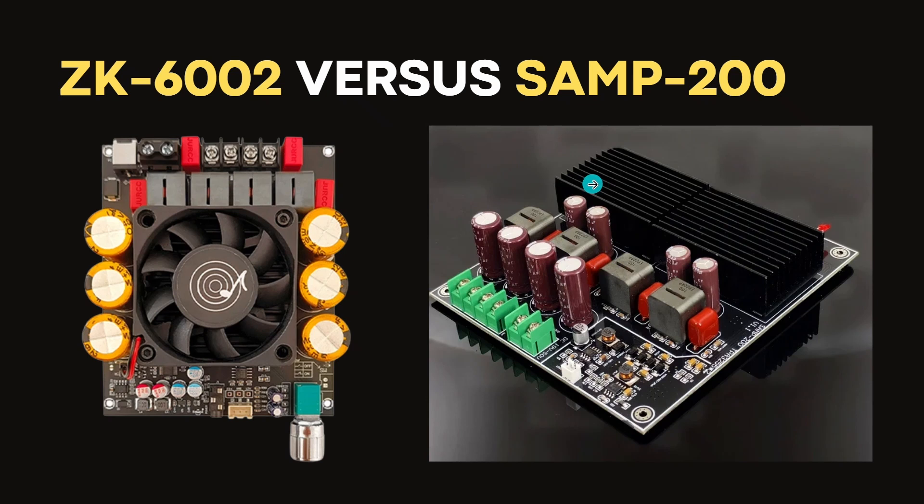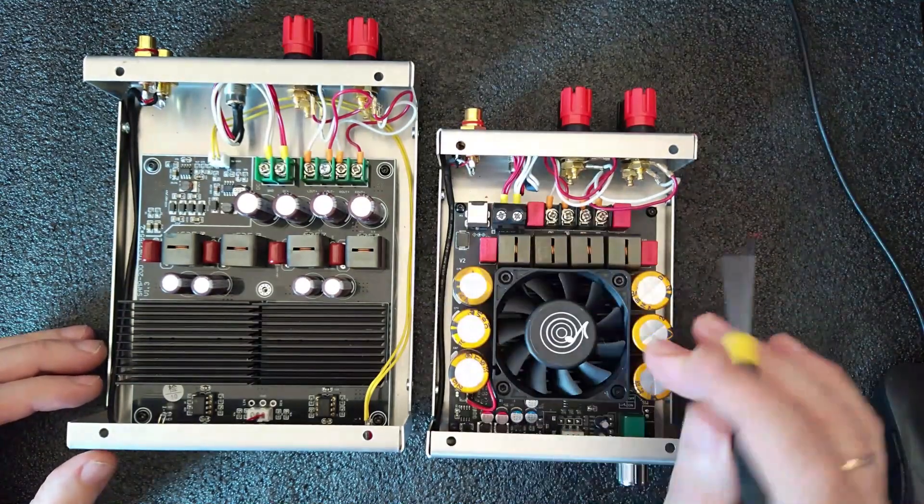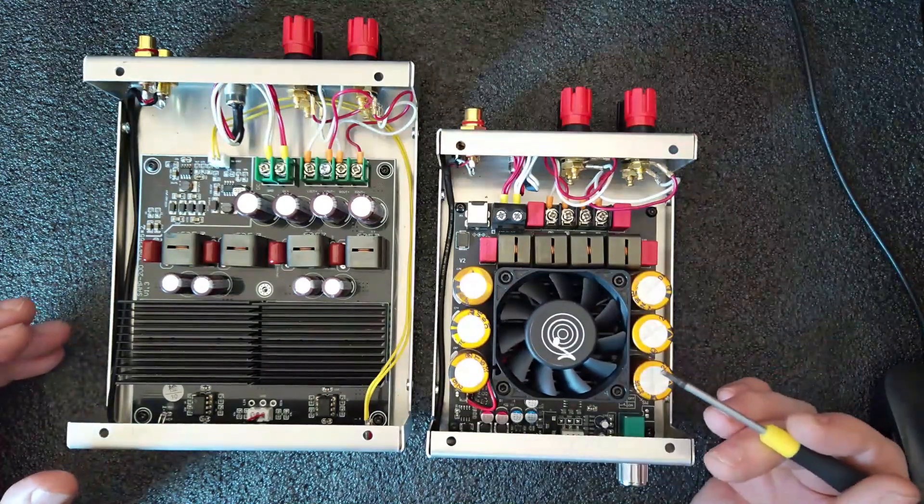You need additional cooling because even in 10 minutes inside the box the heatsinks are reaching 60–65 degrees. Can you operate at 48V? Actually you can, but you should optimize the thermal solution and add high quality thermal grease or thermal paste — then you can. I did that for this board. Here I have both boards side by side and you can see that this solution has a smaller footprint and is capable of full capacity.